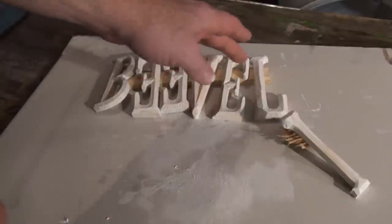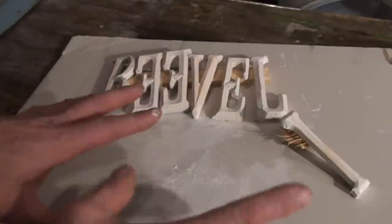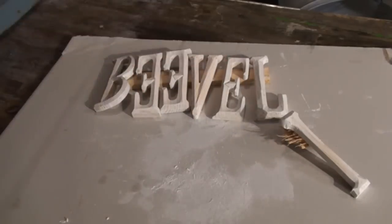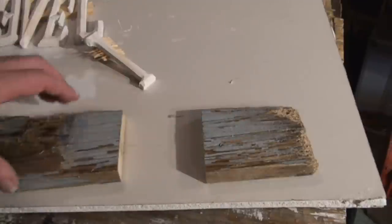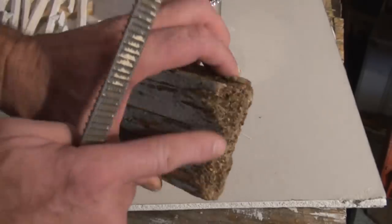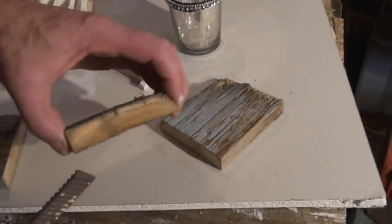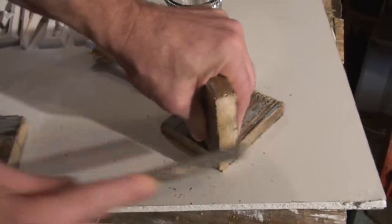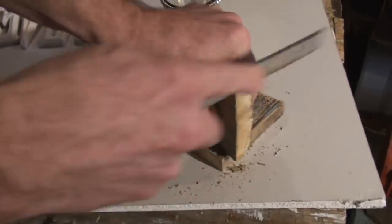I gave them a nice coat of oil-based primer — should be totally dry about 20 minutes for re-coating. I've put them on a piece of scrap wood because I don't want them to dry flat on the sheetrock or table, because then they would get stuck. We've cut that piece of recycled fencing to make little shelves for our hurricane candles. We have a beautiful antique-looking end, but where we made our cuts is too mechanical and straight, so I've decided to take a rasp and just rough up these fresh-cut edges.